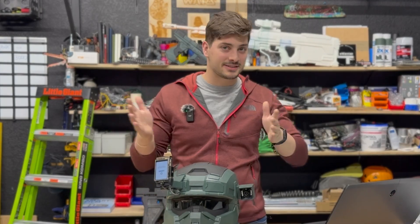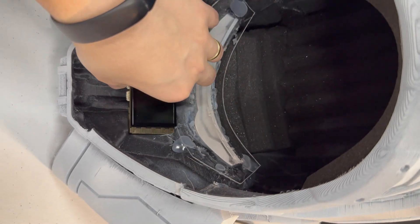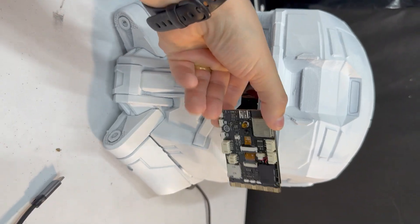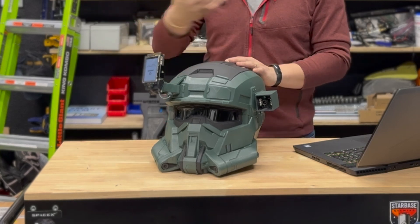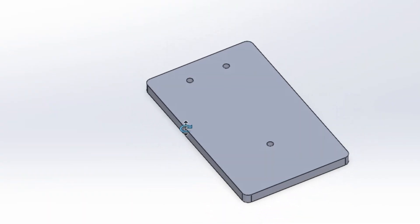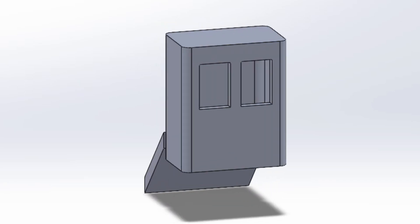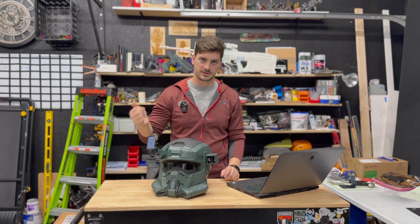Maybe the biggest design trade in this whole build — and what accidentally split the internet when I posted a short about it — is whether I should hide the entire screen inside the helmet or build a hinged standoff mechanism. My eyes just could not focus on the board anywhere inside the helmet where I had room to hide it. I also wanted to challenge myself to a hinged standoff mechanism, because I thought it looked really cool having a top-mounted system, and you don't compromise any visor space when you're not using it. So I designed a screw plate for the back to mount the UniHiker M10, found hinge files on Thingiverse that worked perfectly for a 180-degree swing, and designed a cable standoff that could conceal the cables inside and provide strong adhesion to the helmet to hold the board's weight.